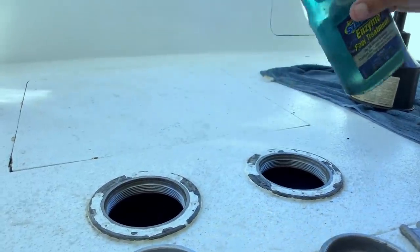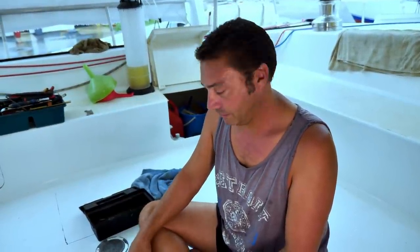Looked at many ways to combat that. Instead, the easier solution was to simply add the Starbright enzyme treatment, which kills the diesel bug. But of course, it never cleans the tank. The tank is still covered in all this dead growth. So 4 years on, we're going to open up this tank and clean it out by hand.